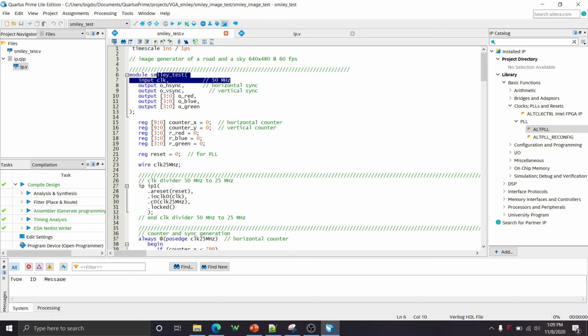So I have a 50 megahertz clock coming in, so that's where I put in clock 0. For the reset, I just have that tied to this low register reset. I could have not used that input, and maybe I should have. The C0 output is our 25 megahertz clock, and that is what's in the sensitivity list of all the sequential always blocks. The locked output I chose not to use, so that's how I instantiated that.